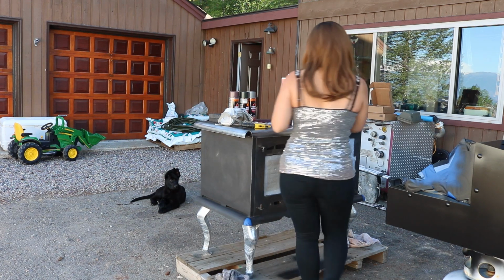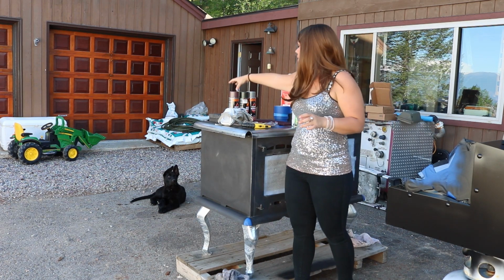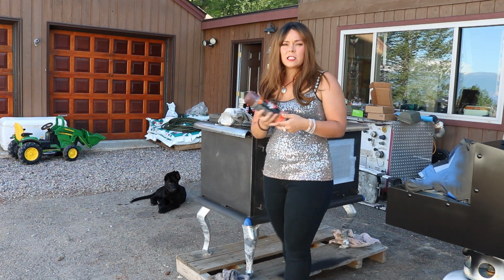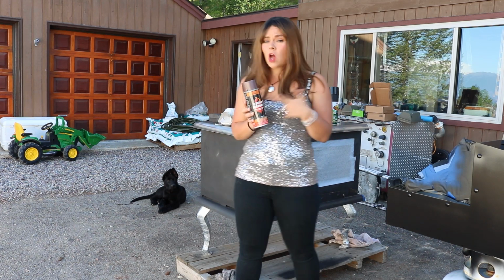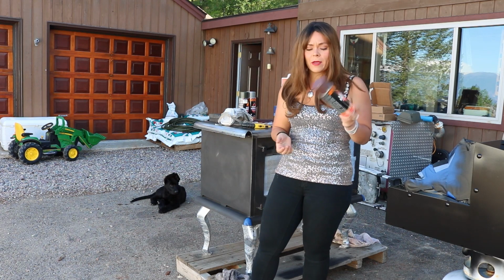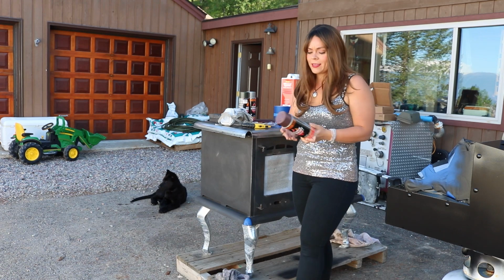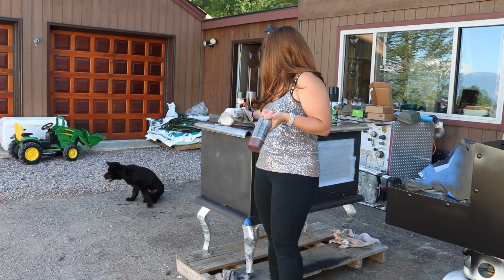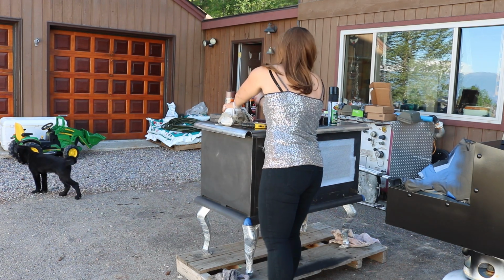So basically, when you're doing this, you can really use any kind of brand of high temp stove paint. It does need to be rated to 1200 degrees. Now Stove Bright is probably going to be the most common and popular brand on the market, and actually most manufacturers use Stove Bright, and Roby does use a Stove Bright. They use the flat black. This is a mahogany color that I have here. This one is forest green, and then we have a silver.